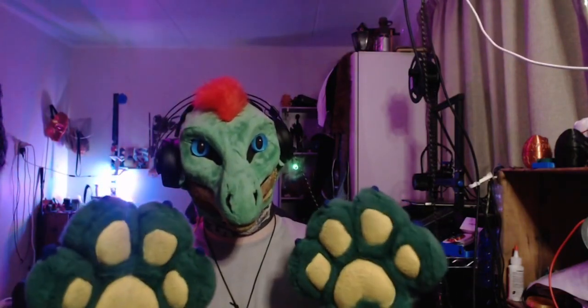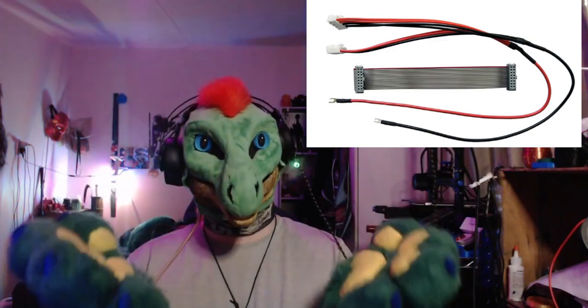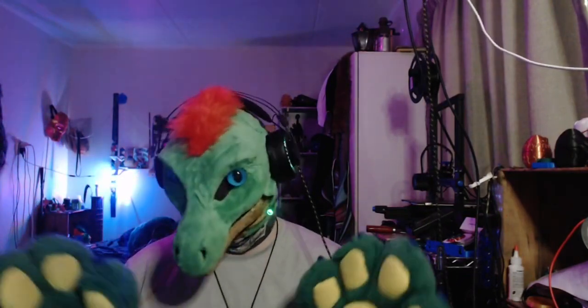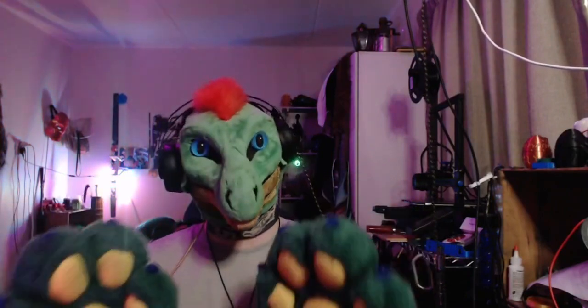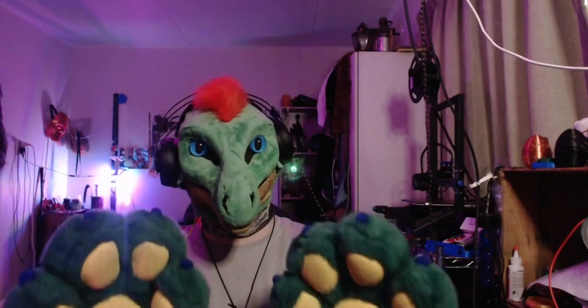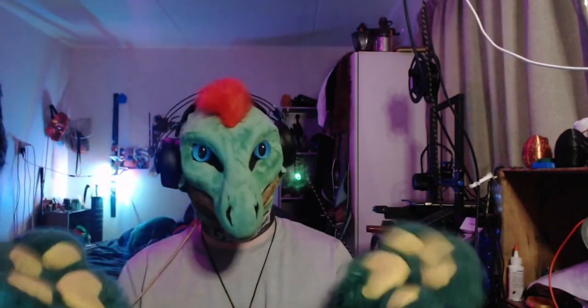Putting it together, when you do buy the actual hub boards for the LEDs, make sure that you buy them with the cables. Otherwise you're going to have to spend quite a bit of time wiring. And I mean a lot. So once you've got them, make sure you get the coloured one or the non-coloured. Make sure that if you get a coloured board, you get the colour capable RGB controllers. Can't stress that enough. I accidentally got one that was not coloured.